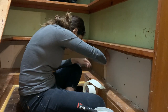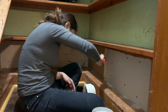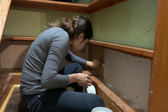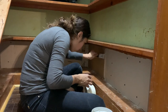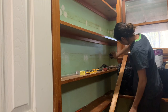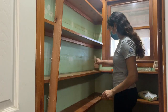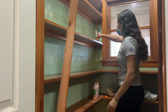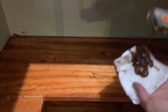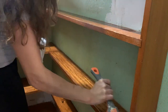If you're new to my channel and not already subscribed, I'd love for you to hit that subscribe button and become part of my YouTube family — I upload once a week with all the DIY content. To get a smooth finish, I sanded all the filled-in holes with a sheetrock sanding block. It was finally time to start on the shelves, so I applied a generous layer of Citrus Strip and scraped it off 30 minutes later. The great thing about Citrus Strip is that it has a pleasant odor and is safe to use indoors with proper ventilation and PPE.